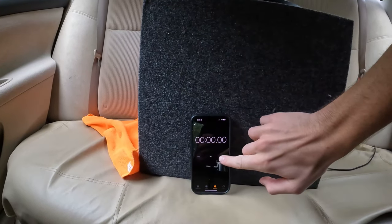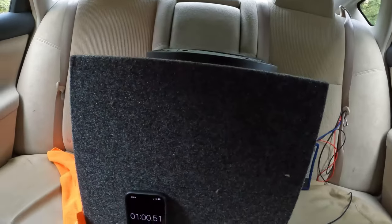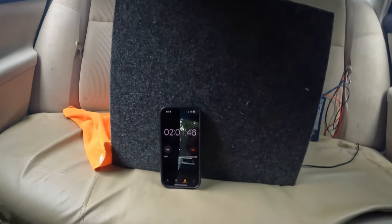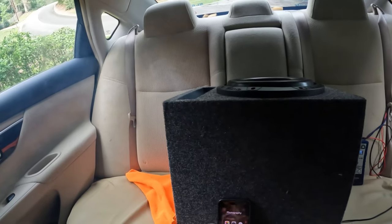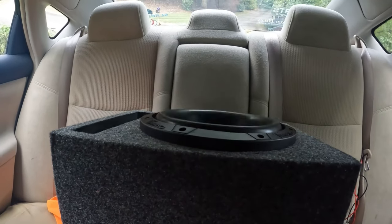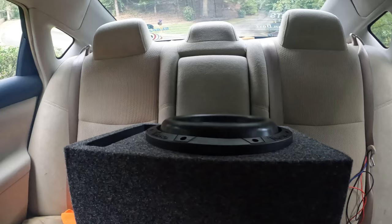Alright guys, let's start the timer and get this thing up to 1200 watts. We got to two minutes and it started to smoke, so let's get it on 20 hertz and cool this thing off. We were pushing it at 1200 watts for a long time. This sub is rated for 1000 watts, but since it has the three-inch coil I thought it could handle 1200 watts. It only got to two minutes at 1200 watts — not horrible. I feel like if it was pushing the actual 1000 watts it would have gotten three minutes no problem.